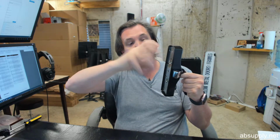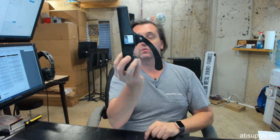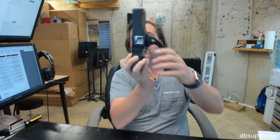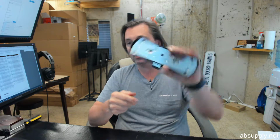So if you've got your knob up here, you're going to want to make sure that your crossbar is at the proper height. Keep in mind when you drill that 2 1/8" hole, if you have to, your bar is going to be down here. Well, I suppose it could be right here as well, however you're going to install that. They put that at either end because they're obviously made to be turned over and reversed. And the template is going to certainly call your attention to that.